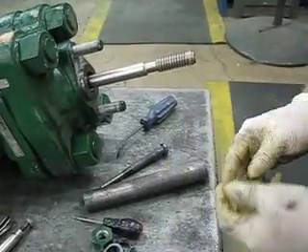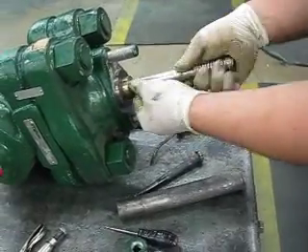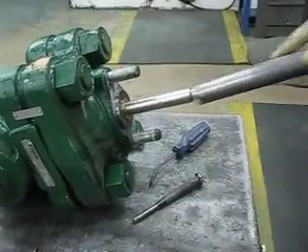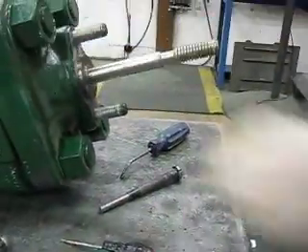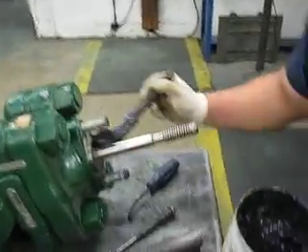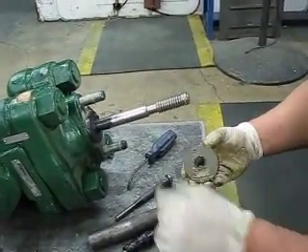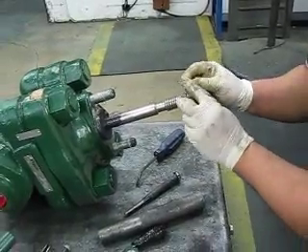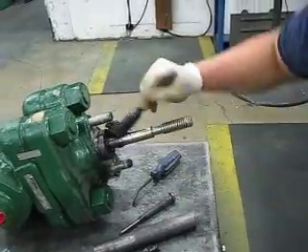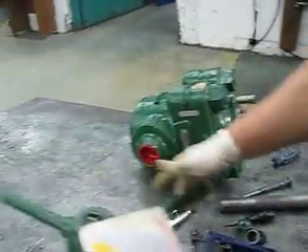Okay, and then your gland ring — here we are, there you go. Just put grease on top of the gland ring. Put your retainer back on, grease on top of your retainer, and put grease on your stem. Now you're ready to put your top assembly back on.